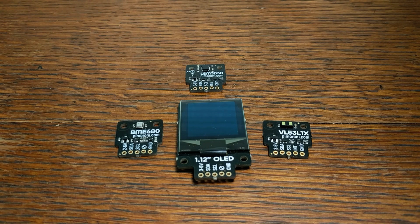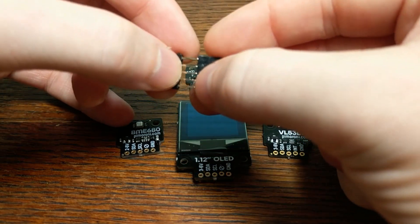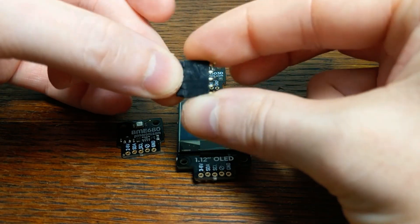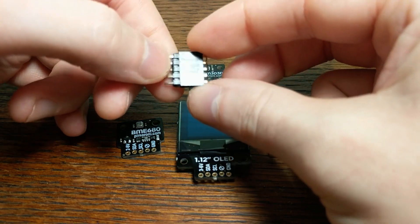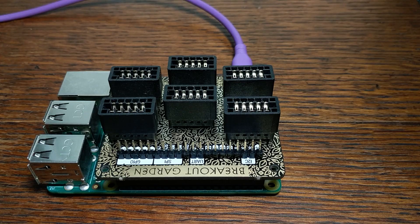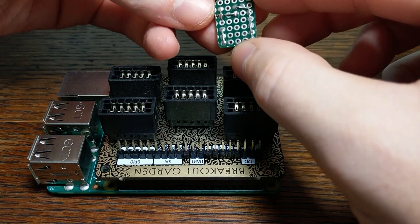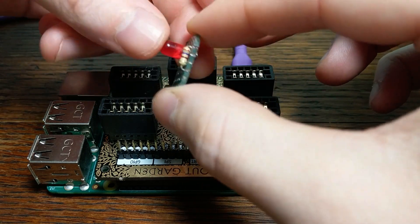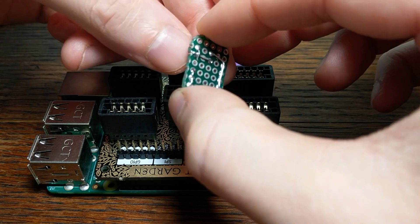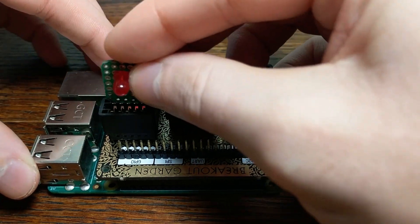The breakouts can all be used on their own too, if you feel like soldering some header pins to them. Each one of them comes with their own set of male and female headers that you can solder on however you'd like. The only downside is that they won't fit in the hat anymore. If you know what you're doing, you can also make your own breakouts, since the pin spacing is the same as most perf boards. In this case I just soldered a resistor and an LED to where the positive and ground connections are, but if you have a chip with I2C pins, it'll work just fine too.